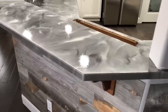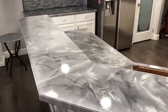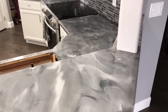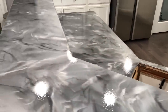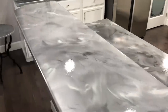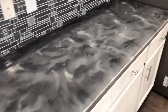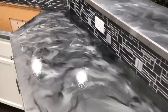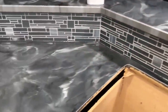You can see how all the brush marks went away after the epoxy self-leveled and cured. That's why we call it the living resin — it's moving and flowing and blending for the next eight hours while it cures until it reaches its hardness and doesn't move anymore. It's a really amazing product. That's why they always look different ten hours later — all your roller marks and brush marks go away, and you have an awesome blended marbleized countertop that's truly one of a kind.